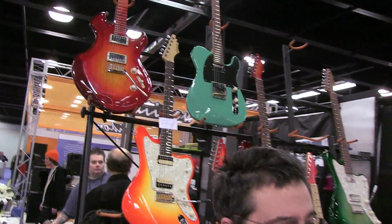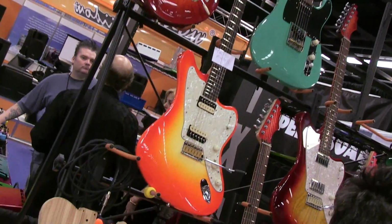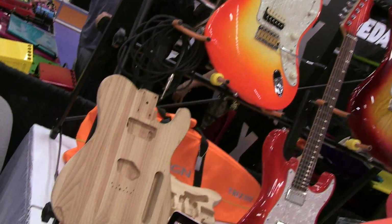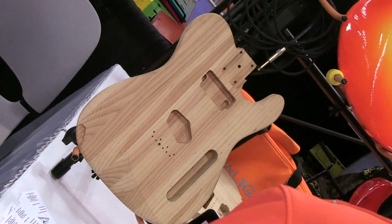We're building everything in-house on our CNC machine. The fretwork is finished off on our Plek. Our bodies and necks are carved to be as ergonomic as possible. We've also found that the carving of the bodies really enhances the tone. We've found ways to cut the body so that you could hit it anywhere on the body if you're holding it by the bridge, and you can knock it with your knuckles and it rings out with the same value.